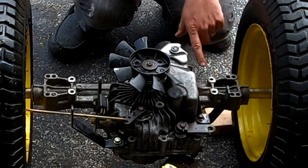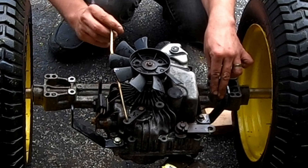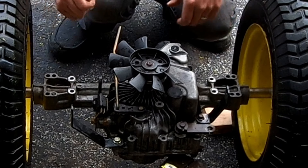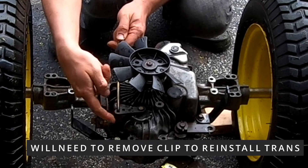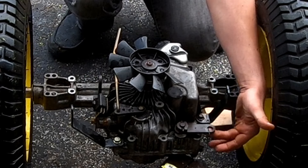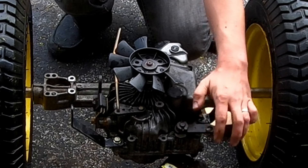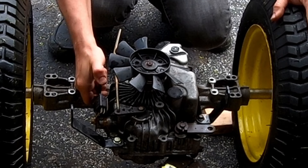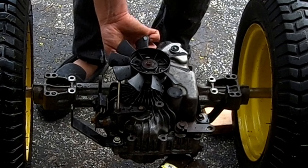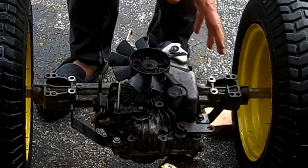There's really not a whole lot to take these transmissions out — it was four bolts. You can see how these are designed to fit on several different chassis because there are like three different places you can mount it. Ours was right here with four bolts. This is the disengaged lever — I just unbolted it, it rotated forward, and this just slid out of the hole. There is a clip that holds it in here. Two bolts, and there's an electrical connector right here with a clip that the pedal lever went into. That would be the brake pedal. On the left side of the tractor there was a rod that went in here as well — this is the actual drive pedal, and that was pretty much it.